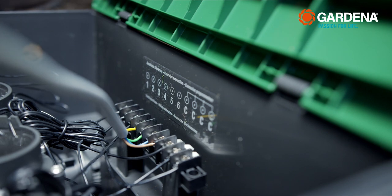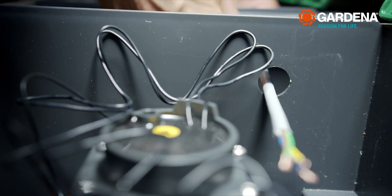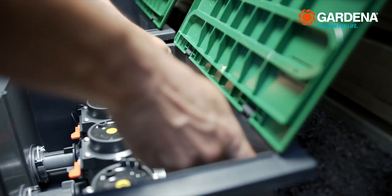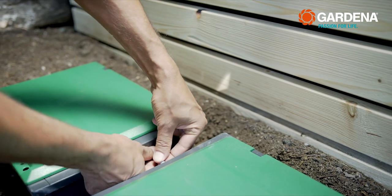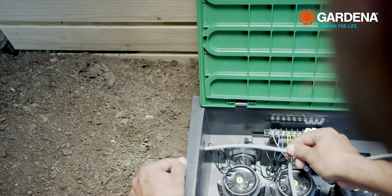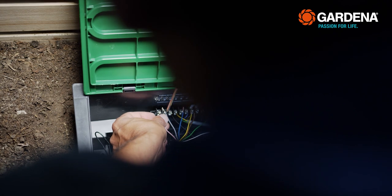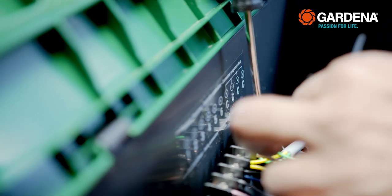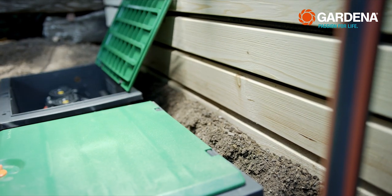Then connect clamps 4, 5, 6 and C of the first valve box and clamps 4, 5, 6 and C of the second valve box with a short piece of cable. Next comes the connecting cable for the control unit. Insert the rubber seals into the provided holes in the valve box — the connecting cable can run into the box on the left or the right as needed, just use the seals accordingly. Insert the connecting cable into the valve box and hook up the seven individual stripped leads to clamps 1 through 6 and C of the terminal strip. Then close the valve box securely and bury it.